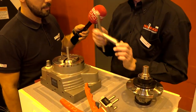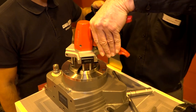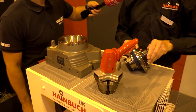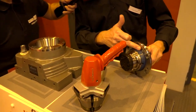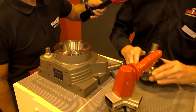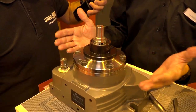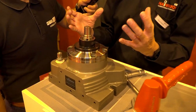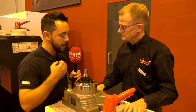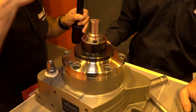One of the beauties of this is we can now take the collet out as you would in the turning environment, and then we've got a Mando Adapt which, if you look on the bottom here, has got a zero point and is designed to sit in here within five microns. So we put it straight in and hey presto we've got a mandrel attachment where we can hold internally. That flexibility is absolutely phenomenal for the right applications — you've got this expanding mandrel, and this is also machinable as well if you had to hold on an inside shoulder.